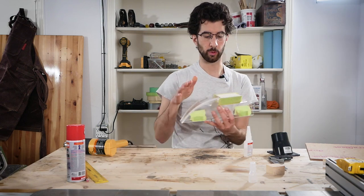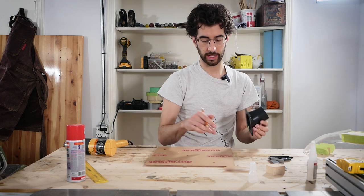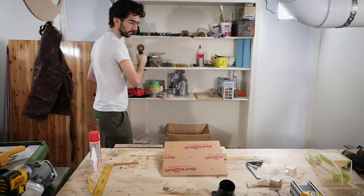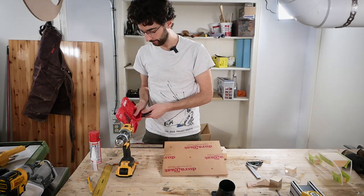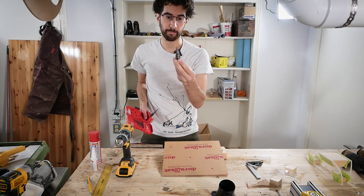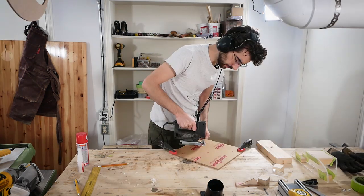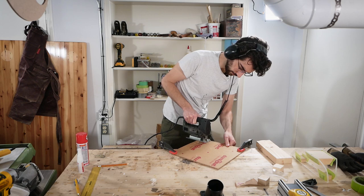Now I'm going to make an acrylic piece to go over the flat part on top, which this will bolt to. Instead of cutting out the piece first, I'm going to cut the hole out for the dust collection — I'll drill a hole and use a jigsaw. I've found that normal twist bits can break acrylic if you're not careful, but metal step bits work really well in acrylic.